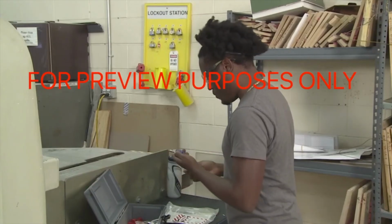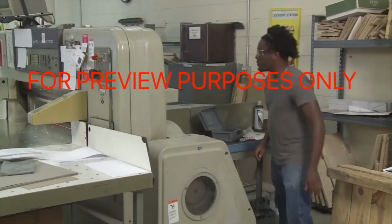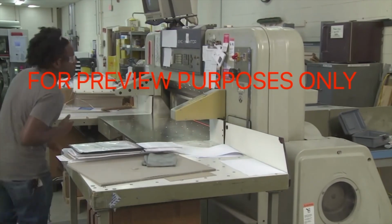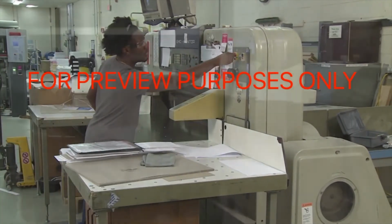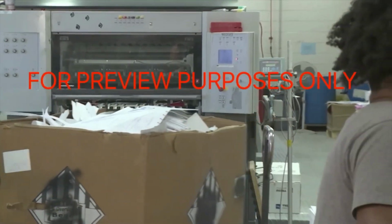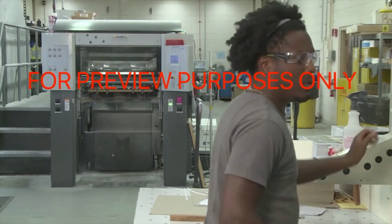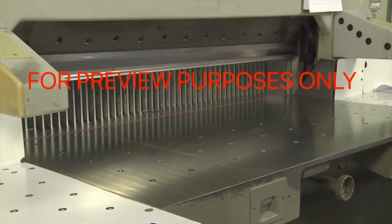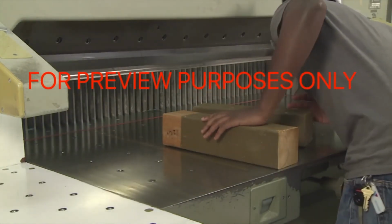There is one additional precaution that should also be taken when you are working with hydraulic or pneumatic equipment. These systems often include heavy moving parts. During lockout, you need to make sure that they can't slip. Because of the nature of the equipment, these parts can often be affected by vibrations from nearby vehicle traffic or other machine operations. Wedges, blocks, or pins can be used to secure moving parts in these situations.